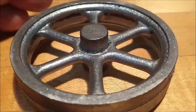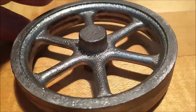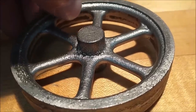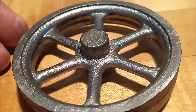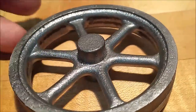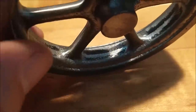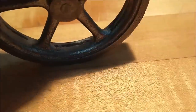We've got about two hours invested right now. I'm focused on the inside of the spokes where they meet the hub and where they meet the inside of the rim. One easy way — and I've done this on other flywheels — is to use a black magic marker to mark up the surface you're filing down. You can better trace your progress with the file; it really makes the parting line stand out and lets you know right where your file is hitting. Don't be afraid to keep putting the black marker on there to track your progress.